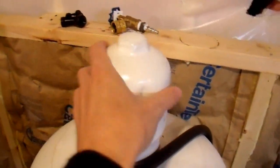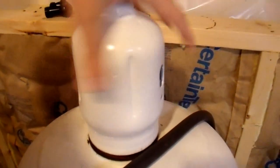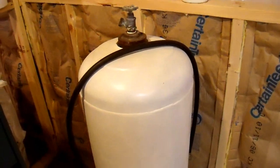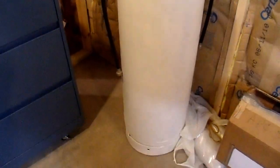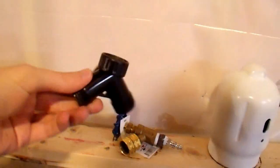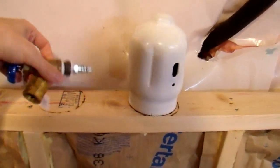So what I have instead is this propane tank — I forget if it's a 60-pound or 100-pound tank, but it's about four feet high. I use this for auxiliary air and it works great. You don't necessarily need to have a propane tank — they're great sources of free tanks — but you can also get the job done with a large upright air compressor. This is my method because I got this tank for free and I already have this air compressor. You also need a few miscellaneous fittings: I have a washing machine hose and a Y fitting.